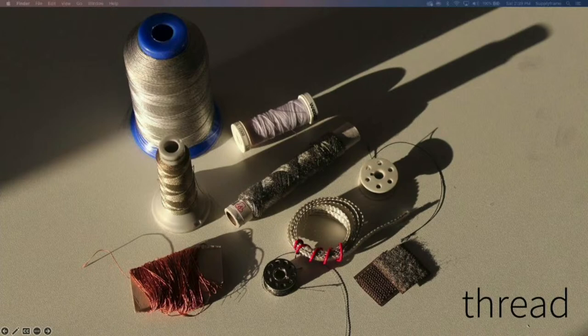The first point of contact most people have with soft electronics is conductive threads — it's the starting point for most people who experiment with this. I'm going to talk you through the different types of conductive threads, my favorites, where you can buy them, and the problems you're most likely to run into. It's actually not been that long since we've had really good thread on the market — we used to have to make do with horrible fluffy stuff that would just cause short circuits constantly. When starting a new project using conductive threads, I ask myself: am I hand sewing or machine sewing? What aesthetic do I want?